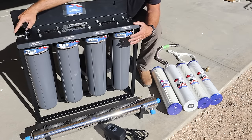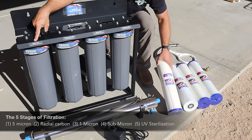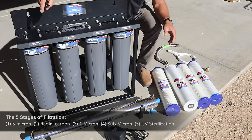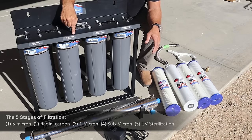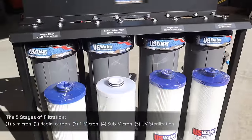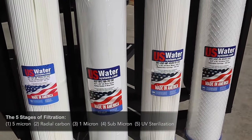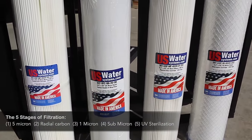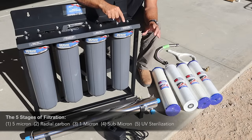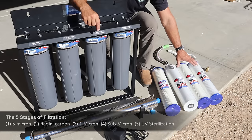So starting out with the largest component, which is this four-chambered filter, the water will be coming in on this side, and it will first go through a 5-micron magna filter, which is this element that sits inside that lower portion. Then it'll go through a radial carbon filter right here. And from there, it'll go through a 1-micron magna filter, which is this element. And finally, it'll go through an interceptor filter right here. And I'll include the details in the description or in the bottom half of the screen as to the specifics of what each one of these does.